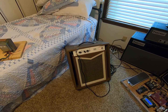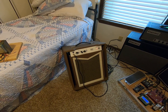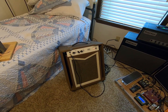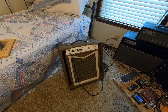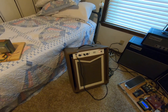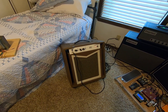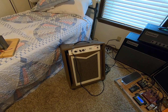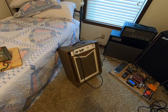It called for, I think it was, a 120 ohm resistor, the big ceramic resistor, and I ended up putting 150 in there, I think, just to cool it down a little bit. But it's still running pretty hot. Can't remember what I calculated. EL84s, I think they want 12 watts of dissipation, but it's still running close to 13.7 or something like that. If you look in the book, that's what it says for an EL84. So they run them a little bit hotter.